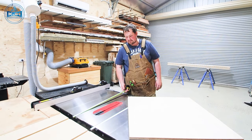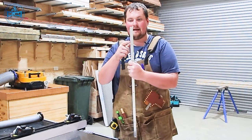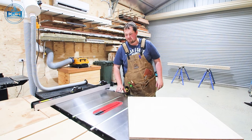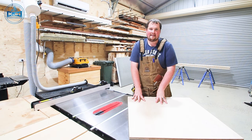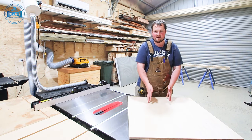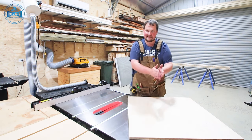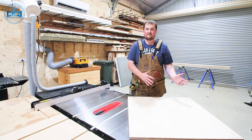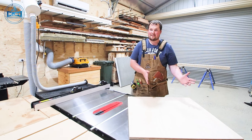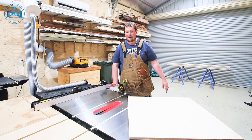You've got your T-track cut to length and drilled with holes — make sure you've got a hole at each edge for extra support. Tape's on there to make sure there's no slack. Now, I never make my saw cut in the center of the sled because that limits its use. If you've got it dead center you're going to have 400mm either side, but if you're offset — I'm doing 530 on one side — that gives me about 270 on the other side. That makes the usability far, far more superior.